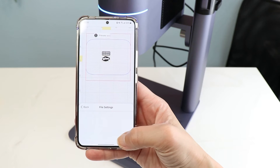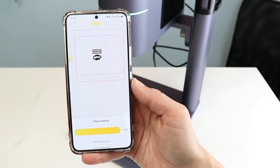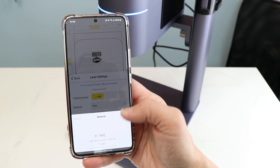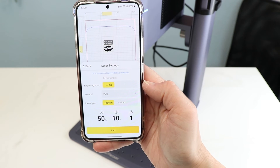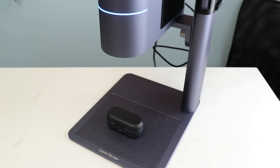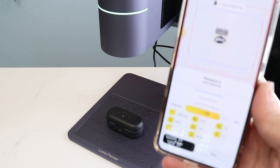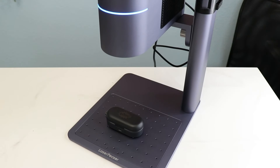Then we hit next and choose the settings. You can choose from 1k to 4k, which is going to be the resolution of the image. I want something light, so I'm going to stick with 1k. The file is sent over to the machine and now I can pick my material. This is a plastic, so I'm going to choose PVC and the IR module. These are the pre-made settings — you are able to go in and change them if needed. Once I'm happy with that, I can hit start and the machine goes. When it's done, my app shows me exactly what happened and this took just 25 seconds to engrave.